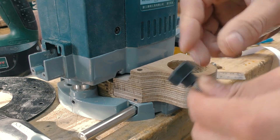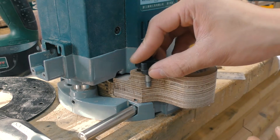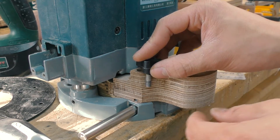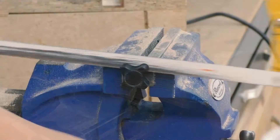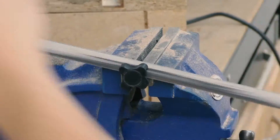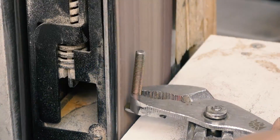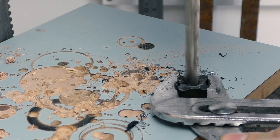For the bolt, I really want to use one with a friendlier head for my hands, but unfortunately it isn't long enough and that's the only one I've got. So I'm going to use a longer bolt and modify the head to fit it. I'm using a belt sander to make the head of the bolt square, and then drilling a hole slightly smaller than the square.